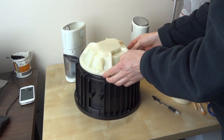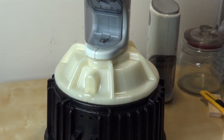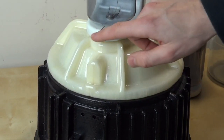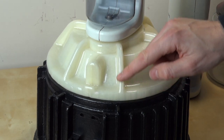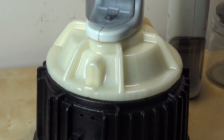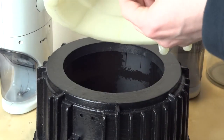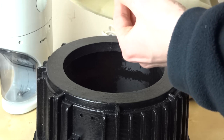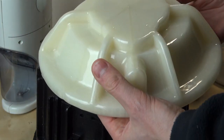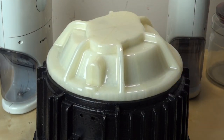I'm in two minds about what to do. In one way I quite like it because it matches the contours of the grinder — it's all nice and round. However, that wasn't how it was in the movie; the corners were a lot sharper. I need to put this back outside for probably a couple of days to see if the acetone will dry out, if it will become opaque again and go hard like ABS — at the moment it feels like a hard rubber I can squidge around. If that doesn't work, I'll have to print a new one and try the acetone bath for maybe three, four, or five hours instead of 12, and keep an eye on it while it's going so I can tell when it's done.